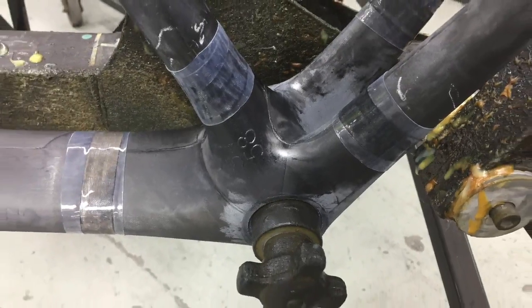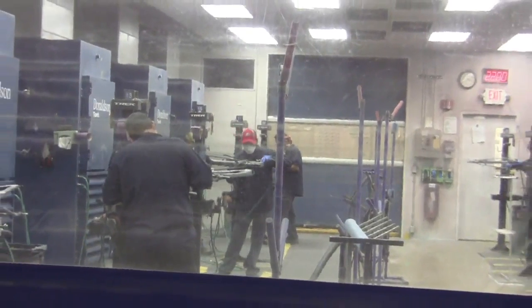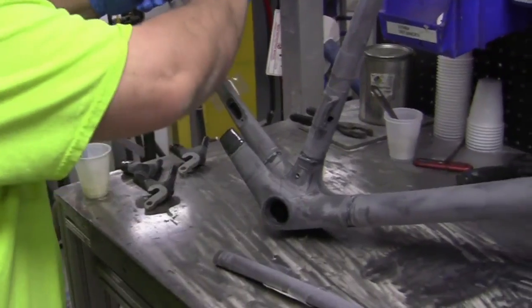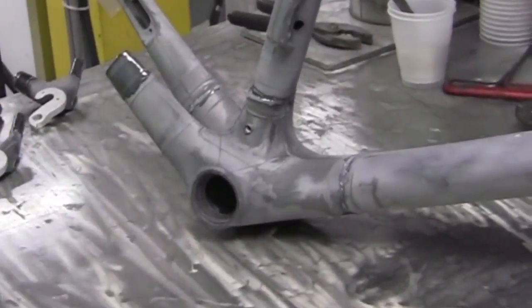One of the things I really like about the unit is that it has a great deal of flexibility. It also has a lot more capabilities than we're actually using. We got heated hoses on the unit, which are great because in our environment we do have a cooler factory area. With high viscosity materials, you have to be careful with that, so we got heated jackets on the hoses. It also has shot size diversity, so we could choose different shot sizes for different dispersion amounts for different parts of the frame.